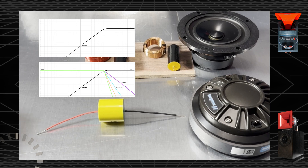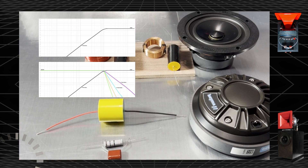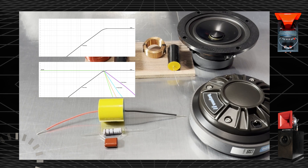There is a resistor here, which is the second leg of the L-pad. The first leg of the L-pad is sitting on top of the speaker — you can adjust that one. This one is not adjustable and remains inside. Here's a little trick: this is a bypass capacitor. It allows you to bypass the resistor, allowing more high frequencies — say above 10 kilohertz — to get to the compression driver, because horns tend to roll off a little of the higher frequencies due to the size of the horn. The bigger the horn, the more it does. We use a special capacitor to restore those high frequencies back to normal.